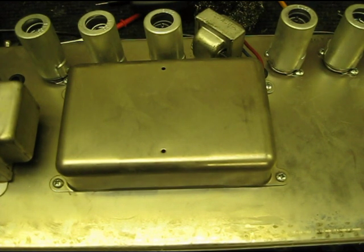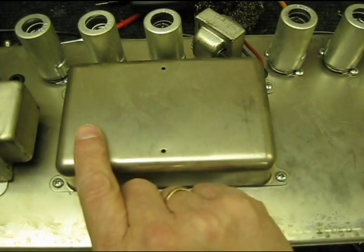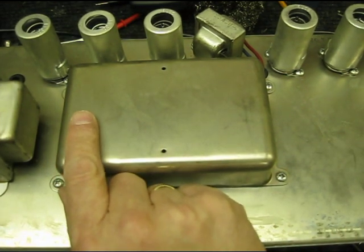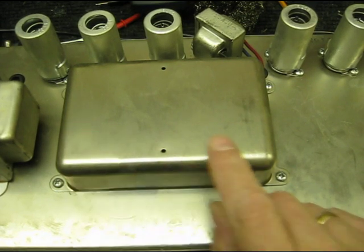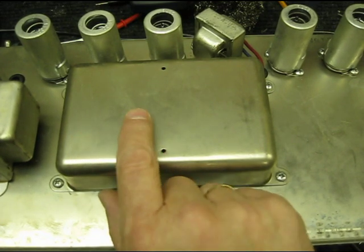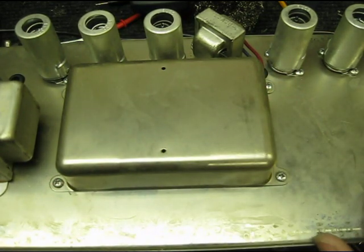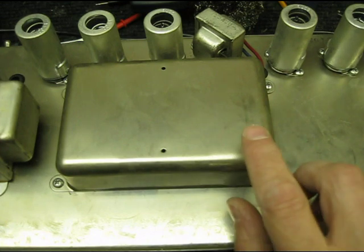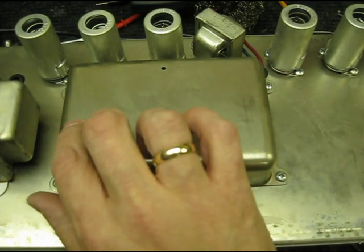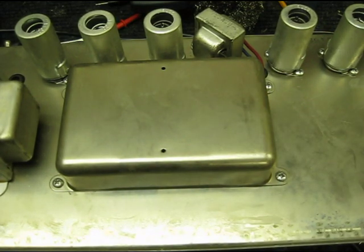You want to carefully avoid over-filtering. If you're using an amp like this on a large stage, you can raise the first filter right off the rectifier tube — the limit is 60 microfarads, after which you'll probably short out your rectifier tube. So you can go up to 60, but then you strictly want to stick with 16-16-16-16-16 to retain the vintage character of the preamp. If you're looking for a more tweed-style character, you could go 60 on the first, then 10-10-10-10. You get some noise creeping in, but you should get a good pick attack and envelope.